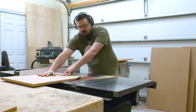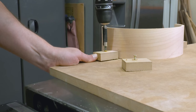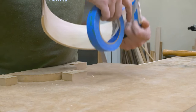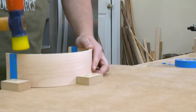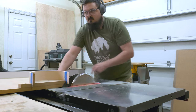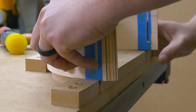Back at the table saw I cut a clean edge on my sled and used a half-circle template to trim off the edges of the bent lamination. The template holds the pieces in place while I run the sled against the fence, giving me clean lines on both sides of the circle. I added a few blocks to pinch the work piece in place, and added blue tape around the edges to avoid tear-out. I made the initial cut, then rotated the piece, lining it up as close as I could to the edge, and made the second pass.